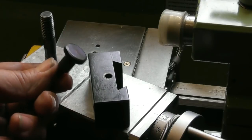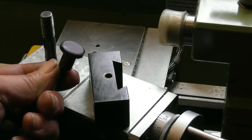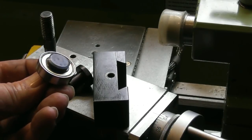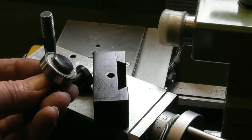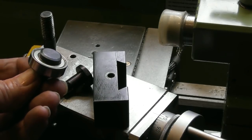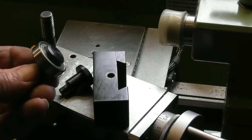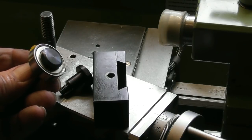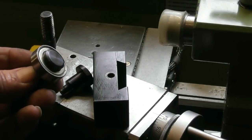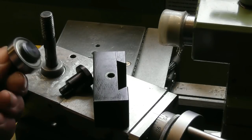As I showed you earlier, I did heat bluing — you can actually see the blue. I'd call it heat purpling that I've done on the fixed stop, and again on the bearing spindles — they were heat blued. It's a purpley blue; I think either I didn't leave it long enough or left it too long, but it's fairly uniform throughout the part. Putting it on that bed of brass chippings seems to have done the job of evening out the temperature. So that's the push tool assembled and complete.